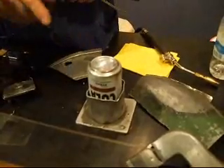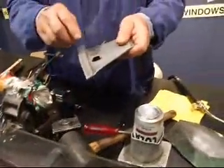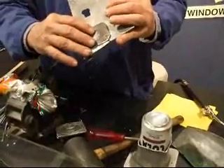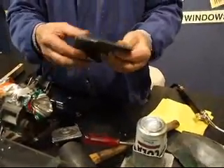Remember, it'll do aluminum, die cast, copper, brass, bronze. If you have a large hole to fill like this, which is too big to bridge, clamp steel behind the hole. Fill it in and when it cools, the steel will drop away. Remember, it will not bond to steel.